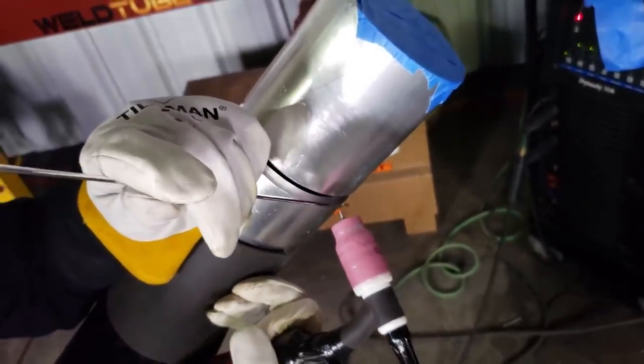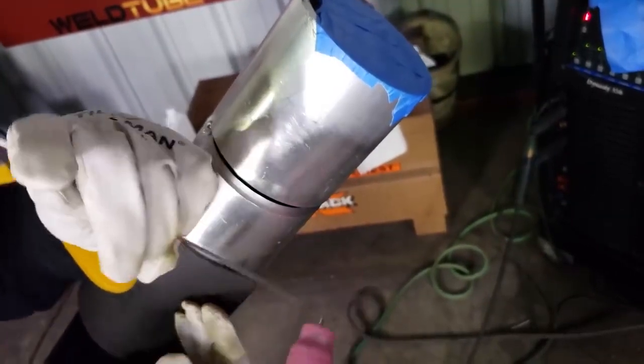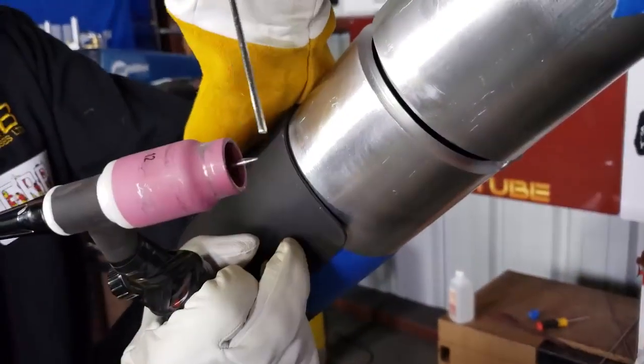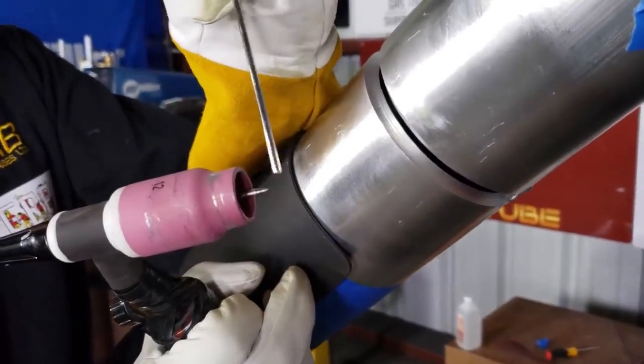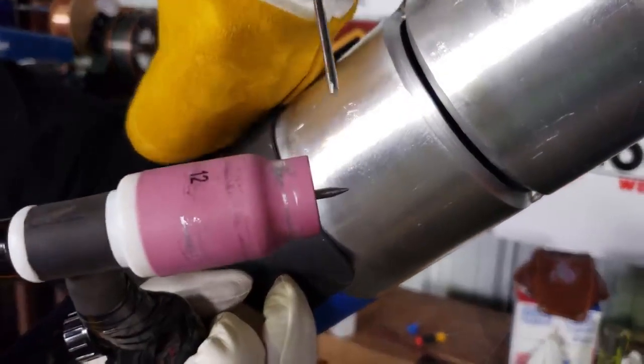And then when you dab it, it's not dab and pull away, it's dab and lift upward so that it's always protected within the inert gas. Because if it's dab like this, it's good. If it's dab like this, then it removes it away from the atmosphere.